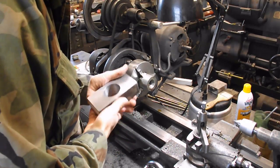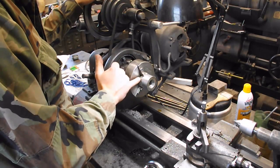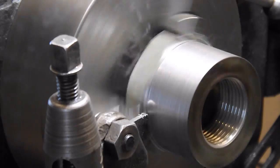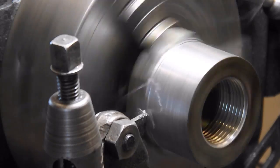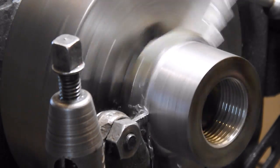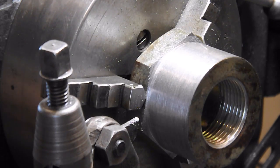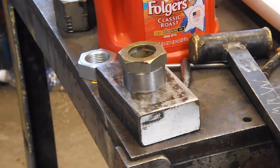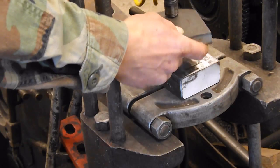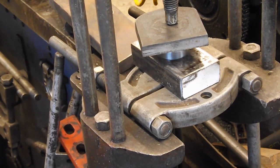It's hitting pretty hard all the way around. I'm going to get out the parting blade — I'm going to make a little groove in here so I can get this hex flat up against this curve when I press it in. Yee-haw, that went real easy — I almost got excited and started parting clear through. It feels pretty good, so I'm going to go ahead and take it over to the press. Oh yeah, that's good.